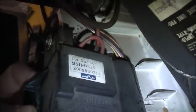There's a power transformer there. Very handy to keep these old types of power transformers. Uses an earth type like the Mitsubishi TV I showed does. These older TVs with the earth cables have a good power transformer in them. And here's a little flyback. This is a Murata flyback. Don't think you've ever seen a flyback quite like this before. Murata, made in Japan. Focus is external. Variable resistor or potentiometer. If that starts playing up, you can easily replace them. No pins, just wires, potted straight in. And they come out, and they just plug in separately on the board somewhere around here.